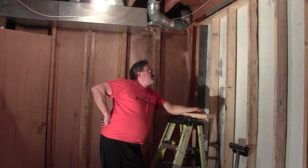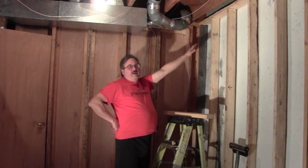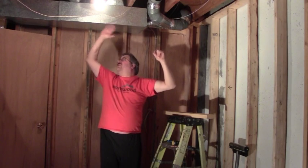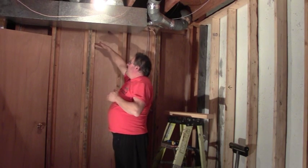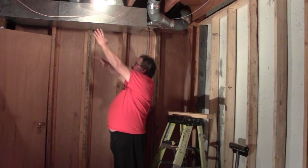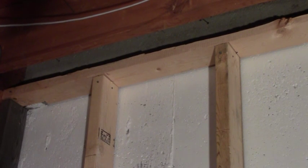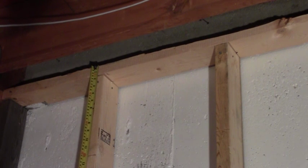What we're going to do is put a cross brace in the wall here to attach our first piece of framing. We're going to make a frame to fit this area and cover the face of the duct. Then we're going to come underneath and make another frame to cover the bottom of the duct, attaching it to the bottom of our frame and then to the wall. I've already done my measuring and I know the bottom of the framing has to be 12 inches from the top of the roof. I've marked off 12 inches — that's where the bottom of my framing is going to come to, and that's where we'll be putting our cross brace.